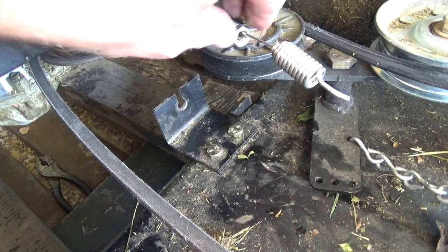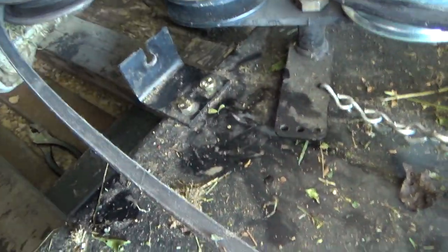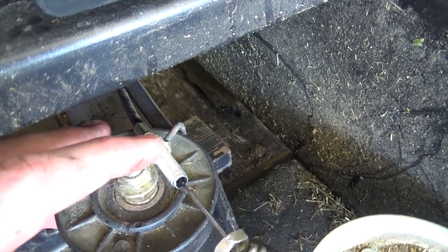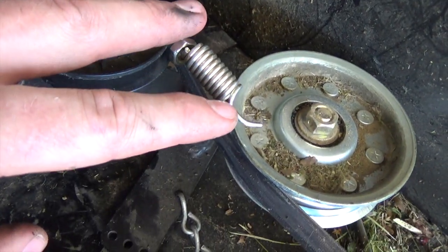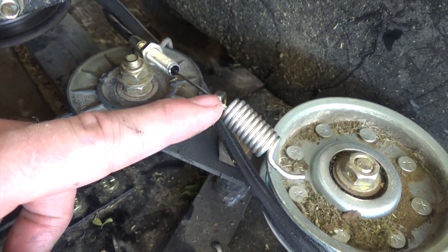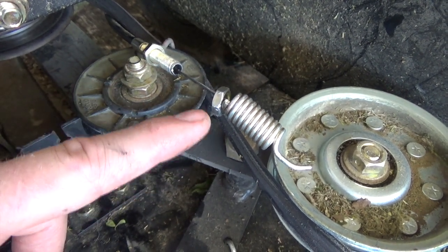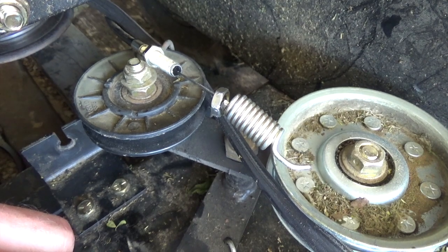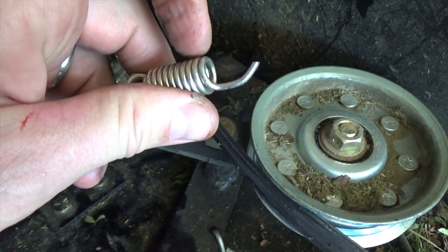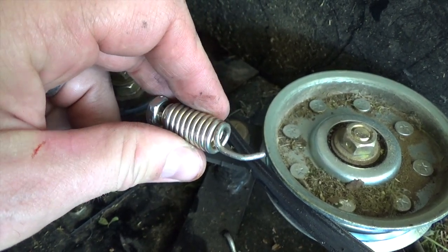To properly work on this spring I had to get the cable out of the tensioner groove. I'm going to have to reset the tension once I have the spring curved — you can see I started it right there. I've got a lot to play with here so it shouldn't be bad, and besides that I still have those three holes so I can pick any one of those. The kicker here is I don't know why this spring broke in the first place, because the steel this spring is made out of is ridiculously hard and very difficult to bend, so it's taken a lot of time.